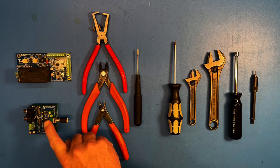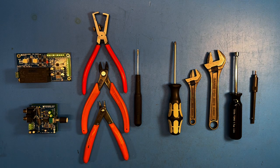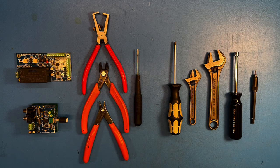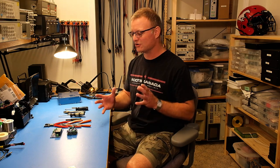The Neurochrome HP 22 is a very simple board. It sits on top of this TI evaluation module for the OPA 1622 and requires very few tools to assemble — it is one of my simplest circuits available. You will need some basic tools like pliers, side cutters, wire strippers, and a small flat-blade screwdriver for the terminal blocks. It's intended to sit on the rubber feet on the bottom of the board, and you can power it with a pair of 9-volt batteries, but it's more fun to have an amplifier in a chassis powered by mains voltage.